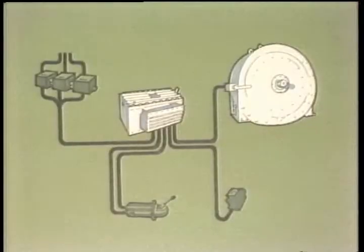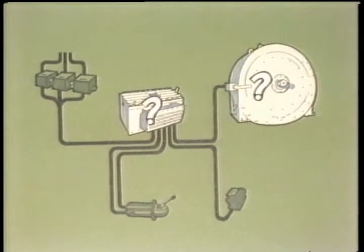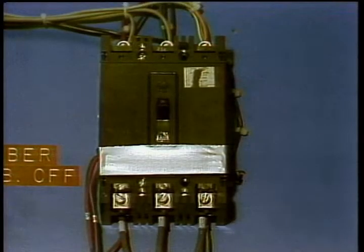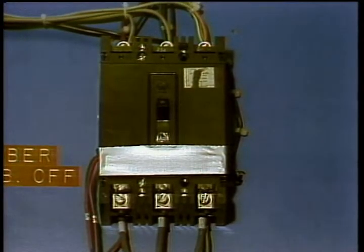Twice a year, you should make these routine resistance checks: the brake coils, the SCRs, power select switch, and the driller's control. When making resistance checks, don't forget to shut off power to the system. Look in the manual for your brake model specs on resistance of each coil. 12 ohms at 104 degrees Fahrenheit is the spec on this 7838 brake.